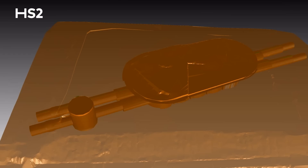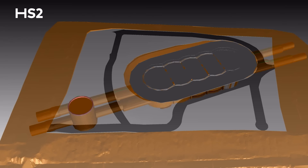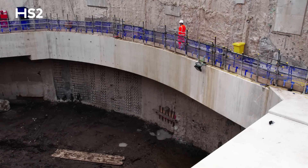At scheme design the box was, as you'd expect, rectangular — but through engineering optioneering we were able to change the shape to the caterpillar shape that you see today. That increases the utilisation of the concrete and transfers the forces around to the props. This reduces the amount of concrete we've had to use by 40%, saves a lot of carbon, and also means that no temporary propping has to be installed, speeding up the construction.